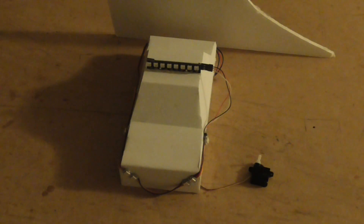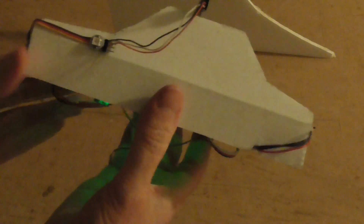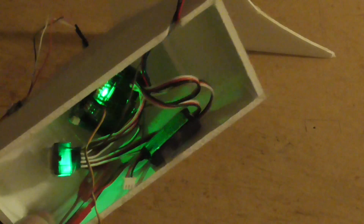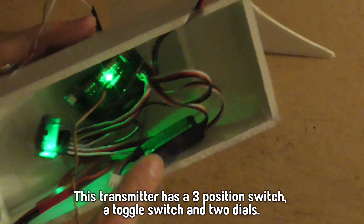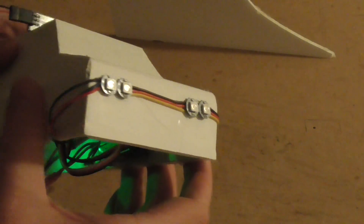Hello! I just wanted to show you this little demo example of some interesting custom lights that you can make with the SBUS mixer. So this is my foam board car — please excuse the crudity of this model. The SBUS mixer is inside there with the receiver. The transmitter is going to be this Dumbo RC 6-channel, which is quite handy for a demo like this. There's a little lipo in there and the lights come out here and they're all in a single string.